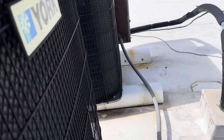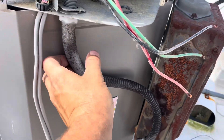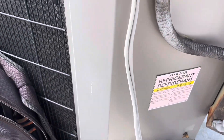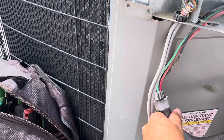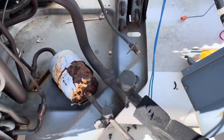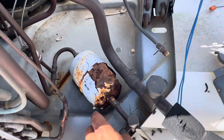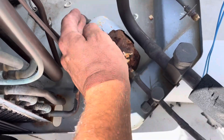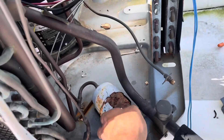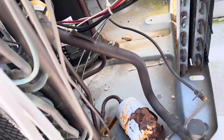It's pretty windy here today, doing the best I can. The maintenance department is seeing if they can come up with any of those fuses for us. We're going to take this panel off here so we can access the filter dryer to get that out. Got this opened up. Ideally, what I'd like to do here is take the filter dryer out, put a little scab of copper in here, and then move the filter dryer out here. I think that's what I'm going to do — just make it easier on myself.